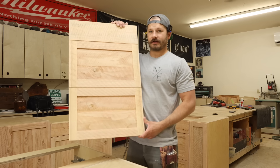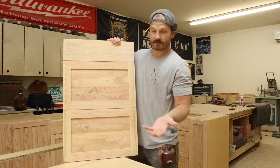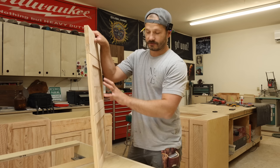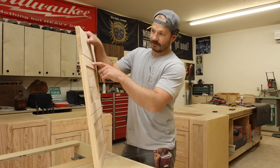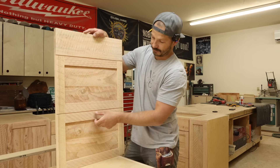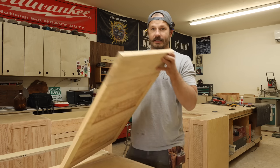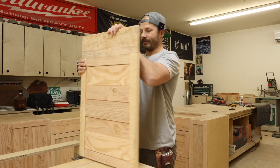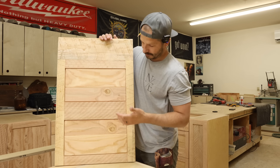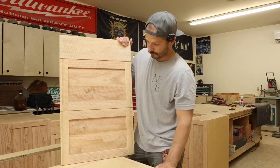So this panel looks just like the three-drawer stack next to it — it's got the same curves and is made to look like a regular drawer stack. What I did: I glue up all my drawer fronts oversized, a quarter inch bigger. I left the top rail finishing at two inches, made it two and an eighth, rabbeted the end, cut down a drawer front for the top. On the back side everything is flush, and I just biscuited, glued, and clamped it together. Looks pretty cool.